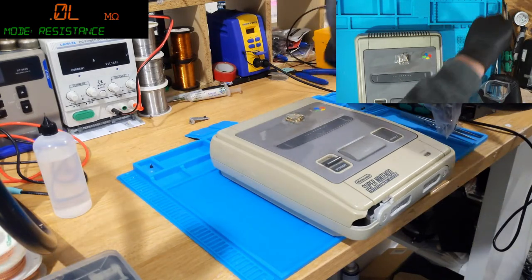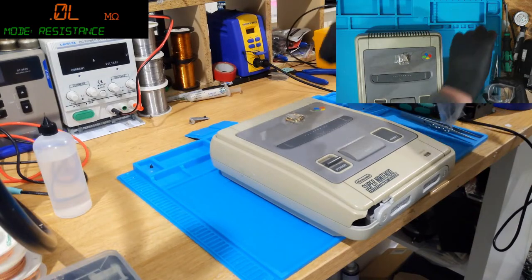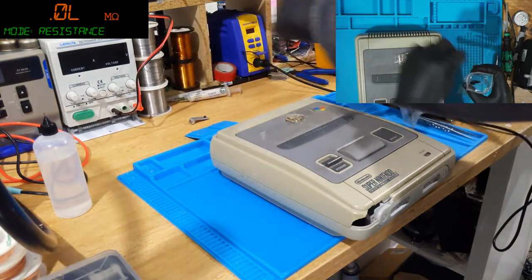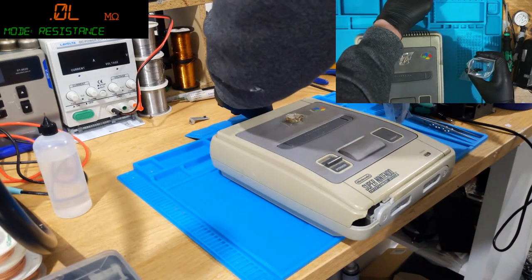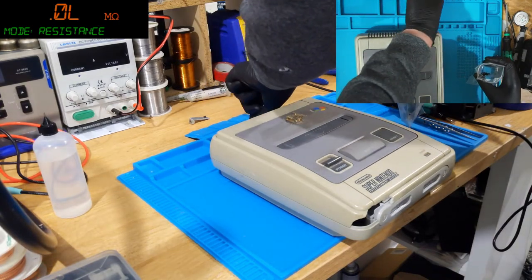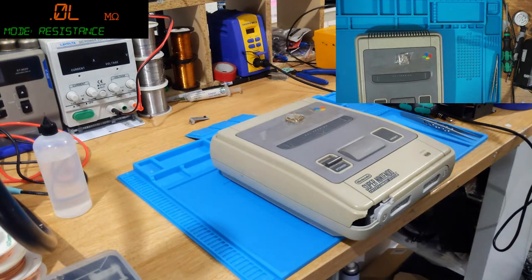And what I'll be doing with this one, I don't have any SMD caps, but I have plenty of radial caps through hole. So what I'll do is use through hole caps, because there is no need, if you're neat and tidy, to use SMD aluminium electrolytics. You can get away with just standard old through hole.